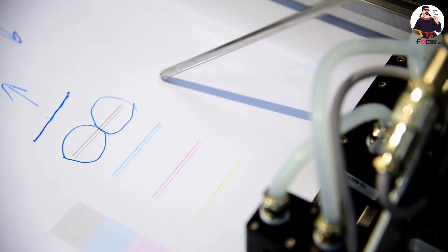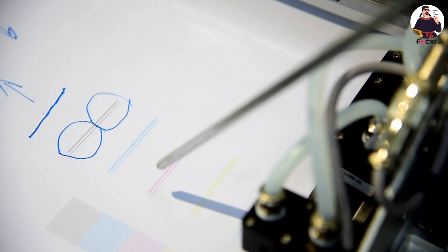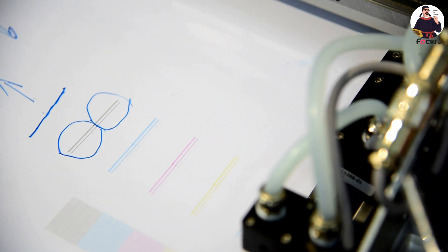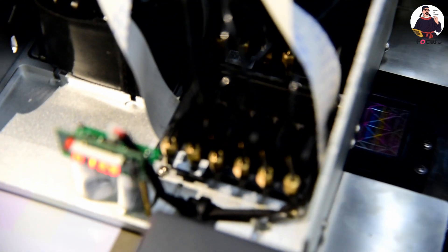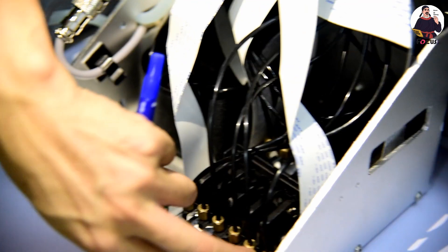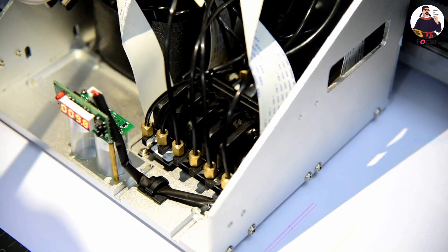This is the vertical calibration for each print head. We can also see the nozzle print for white and for varnish — we must be sure all are printed in a direct line, no overlap. You can adjust by loosening the screw. Push down the image button, move the carriage out of home position. We need to loosen the print head adapter board — screws one, two, three, and four.